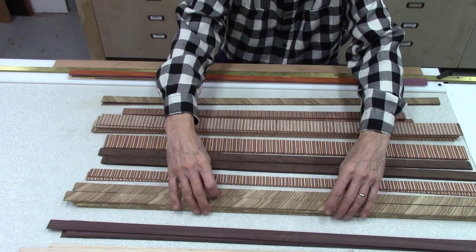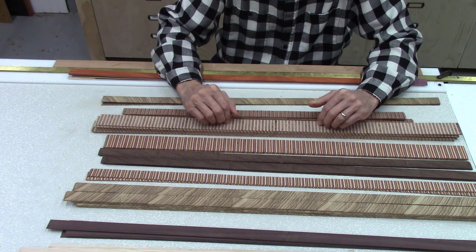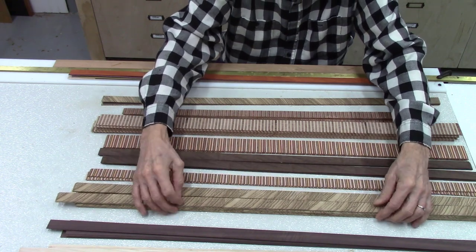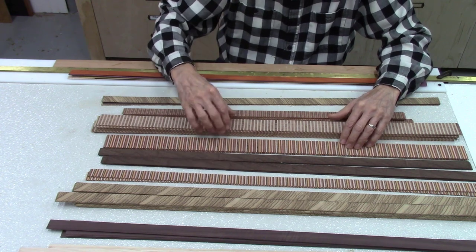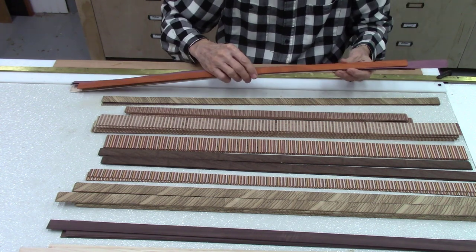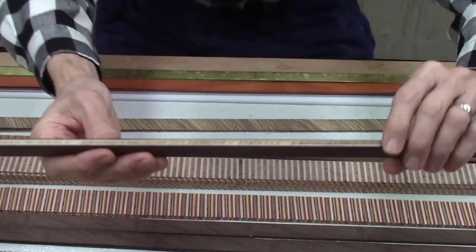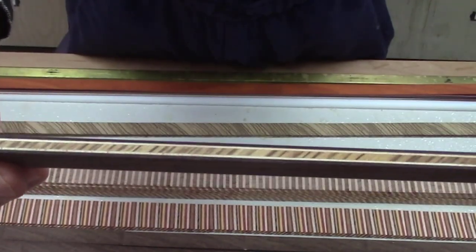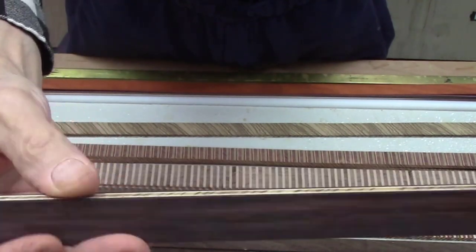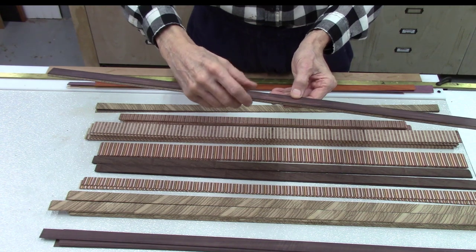The center sections for these herringbone and rope design inlays are all finished. I have a variety of different materials: some zebra wood cut at 45 degrees and pieced together to make longer strips, some wenge, and some multi-layer laminate strips with different patterns and designs. Now these are ready to combine with some of the thin strips I made previously to create unique inlay patterns. This example has zebra wood on the inside with a maple layer and then a katalox layer on top — creating a five-layer piece of inlay strip — which will then be sliced into 50 thousandths inch thick pieces.